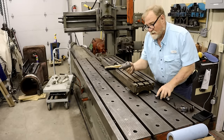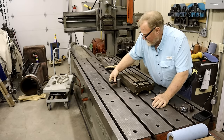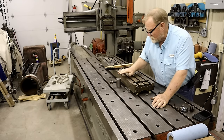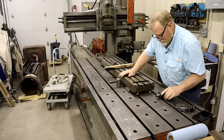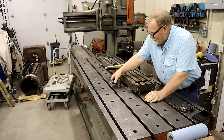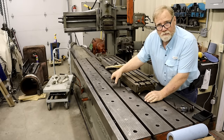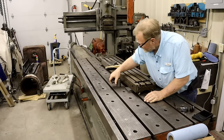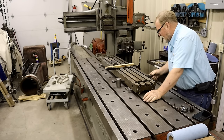These are handy little gadgets. These fit into this 1-inch hole, and I use this to align it and keep the force from moving. The only thing holding it down will be a clamp stop block here and one on the other end. So when you're setting up, you want to make sure you've got these screws to where they can touch, or you get to redo it all over again. I hate doing things twice. But sometimes you have to.